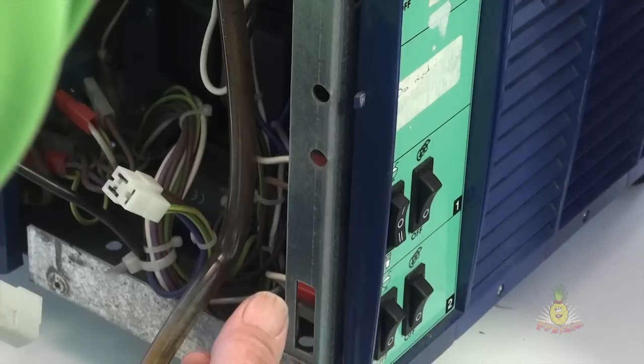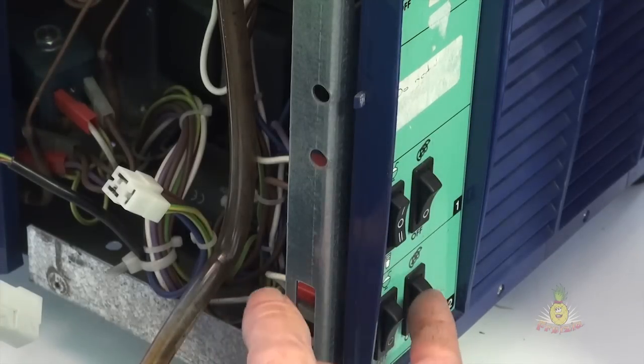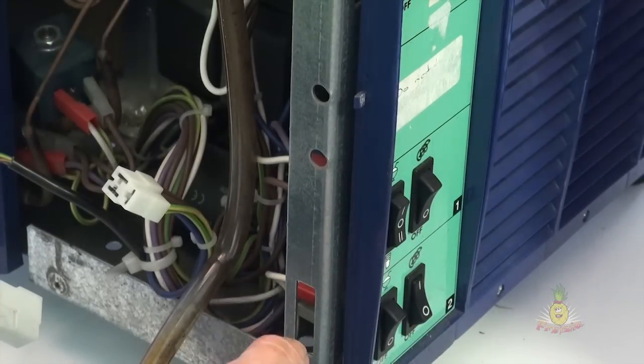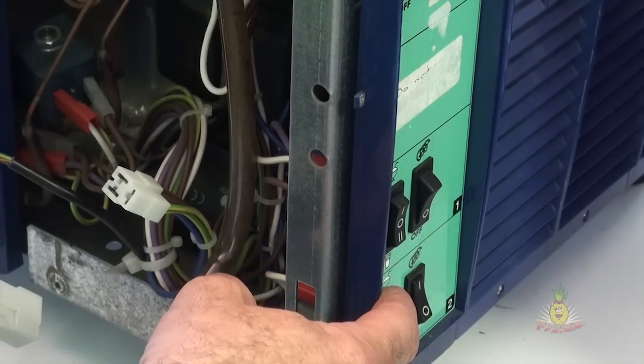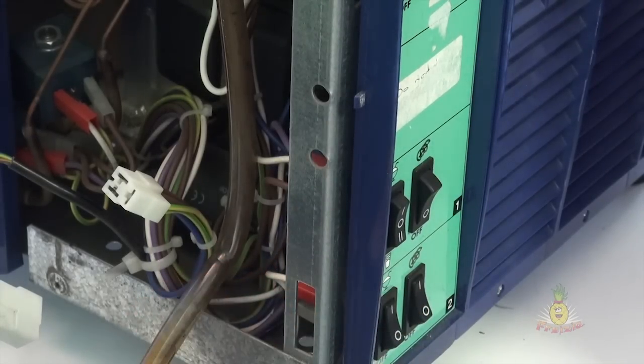misleading. With this machine, when we turn the spiral on, it operates quite satisfactorily. However, when we turn on the chilling switch for that bowl, you'll hear this buzzing noise, which is actually a problem with the electrics, with the solenoid not being able to open, and that will require an electrically competent person to solve the problem.